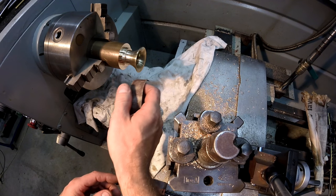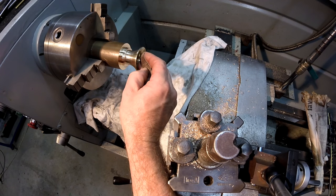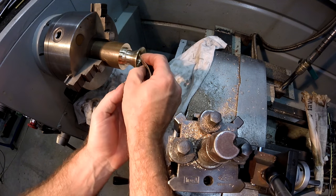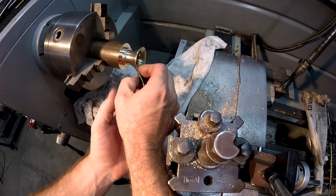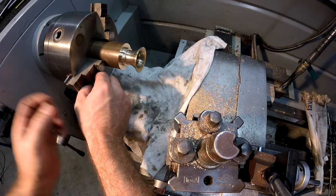I've seen a lot of people polishing from the shoulder. And what I mean by the shoulder, I mean they'll have the emery like this, swinging from the shoulder, and if they're doing the inside like this and they slip off because of the length of your arm, by the time you realize you've slipped off the job, your hand will go straight into the jaws.